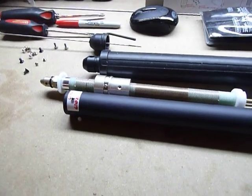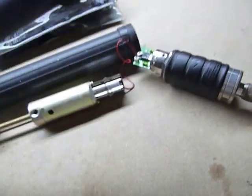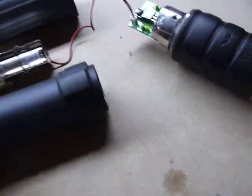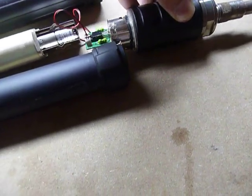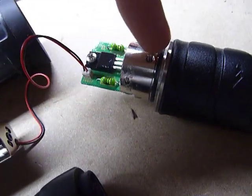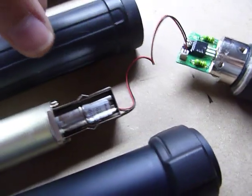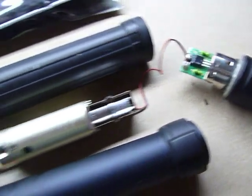The outside housing connects to the top and moves with the main coil up and down, and the whip is hooked to the top of the antenna. Some guys put longer whips on them, but I haven't modified mine. There are only about 11 screws to remove to get this apart. Be very cautious when removing the bottom section where the RF connector is — there is an O-ring there, and if you yank too hard, you'll rip the wires right out of the screwdriver motor.